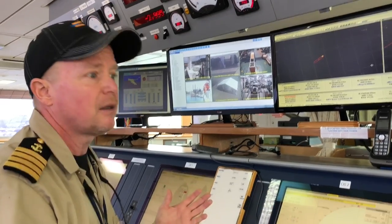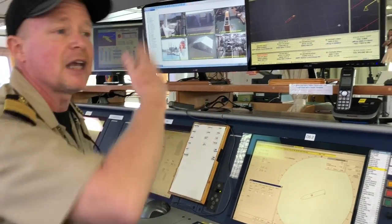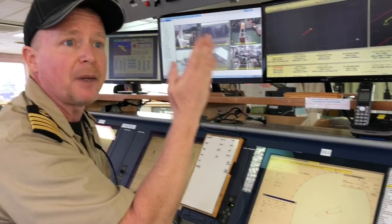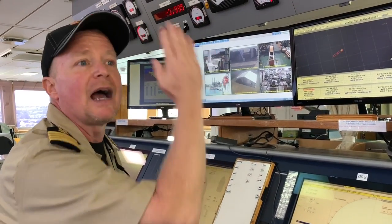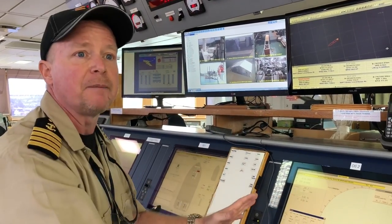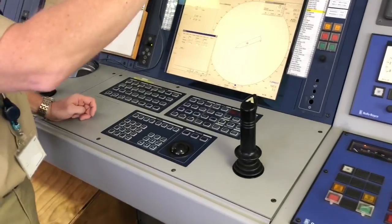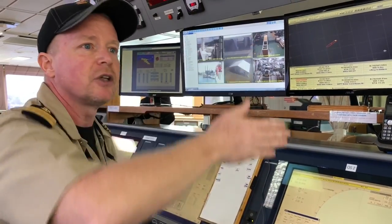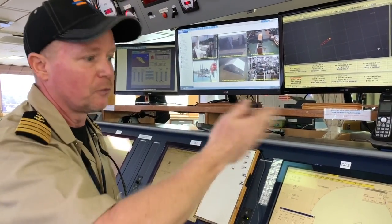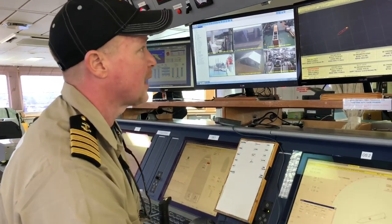We can handle up to, say, 30, 35 knots, depending where it's from. If it gets over that, then what we'll have to do is face up into it, stop the laying of the cable, and just lay and ride it out facing up into the wind, still in DP, because this DP is the best. I've been in this vessel in 55 knots steady on the bow, laying on it in DP with big swell, and it's just real nice. As soon as you take it to the beam or anything else, then it's a different story. But that's it. That's the whole DP thing.